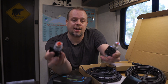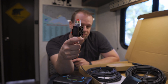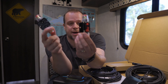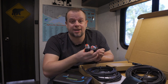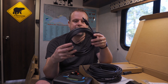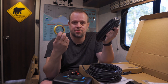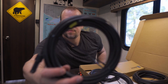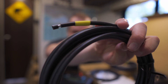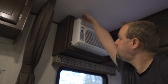Do yourself a favor and get a couple of breaker fuses to make your life easier — one goes between the solar panels and the solar controller, and the other goes between the controller and the battery. That way you have full flexibility to disconnect anything at any time. An additional tip: all the cables are unmarked, so you don't know what's positive and negative. I'm going to add tape to the positive wire, both from the solar panel to the controller and from the solar panel to the batteries.